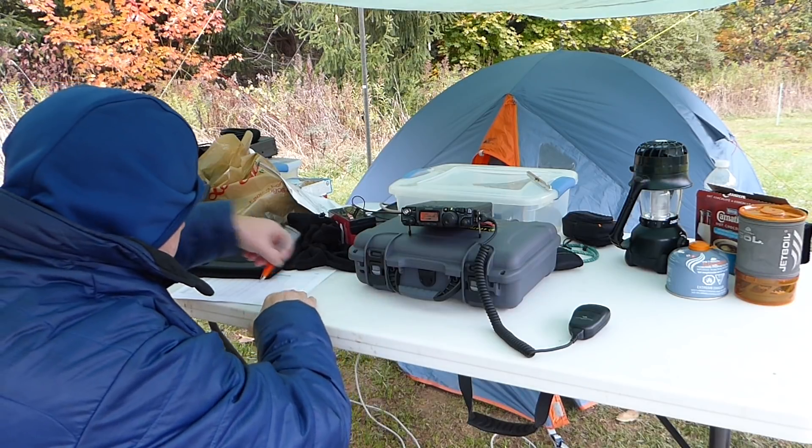Well, that was a good test. I can't tell you exactly how an antenna of this type would compare to a more conventional vertical antenna with a good bed of ground radials. But I can tell you this: shorter antennas that are compromised by traps and coils may not operate as well, even with a bed of good ground radials, compared to a full-size antenna — which is what we're running here on 40 meters. I think this is a really interesting antenna that could provide some possibilities for folks who have a very small area in which to erect a DX-capable antenna. And I really like the idea that you don't have to spend a considerable amount of time laying ground radials down in order to have an effective station.